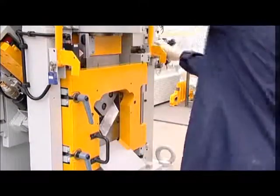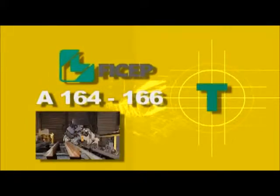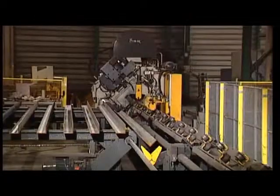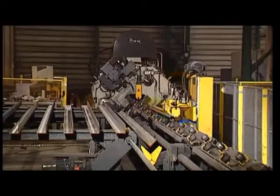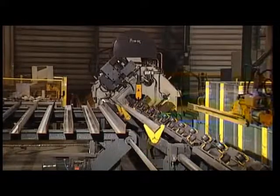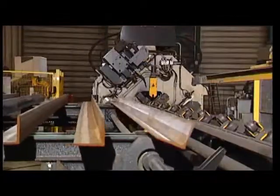To satisfy the needs of manufacturers of towers and other large scale products, FICEP has developed a special T version. These dedicated machines are for angle sections only and retain all the features of the A series, as well as being equipped with a totally automatic integrated loading, handling and unloading system. This increases productivity significantly and drastically increases material utilization.